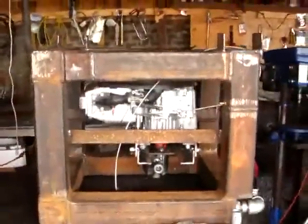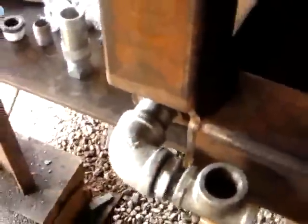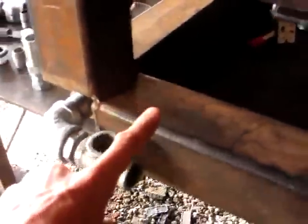Now that everything's in place, the motor, hydraulic pump, coupler in between, as we can see from this angle, I'm starting to build up the suction side. This is where the hydraulic fluid will be sucked out of by the hydraulic pump, and we're going to have one outlet come up, elbow, come round the back, I think, and into there.